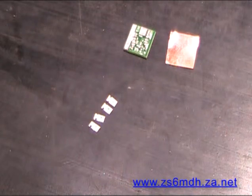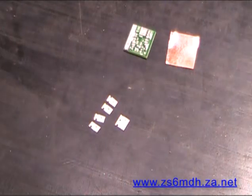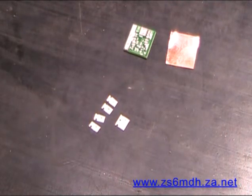Very good. Okay, then we've also got 2 capacitors. They're exactly the same. They are also 0805 and no markings on them. Capacitors don't come with markings, so the markings are on the reel; these components usually come in a big reel. Since we've only got one type of capacitor, 100 nanofarad, you don't have to worry about that. And we've got an LED.